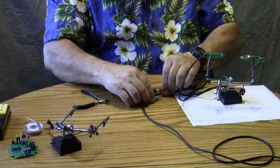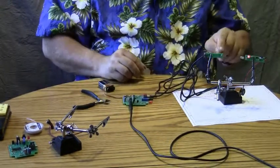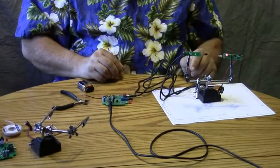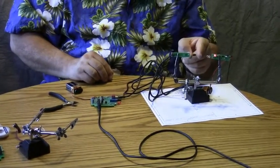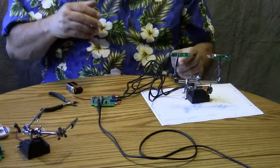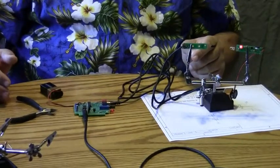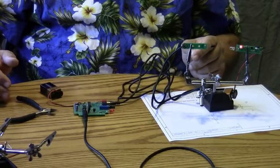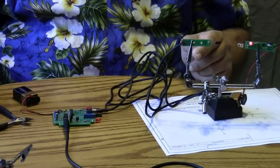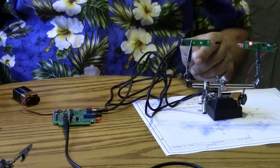But as soon as we connect the IR transmitter to it, the LED comes on, telling me that we have light on the sensor board here, and this is an IR transmitter board providing infrared light. So anytime something goes between these beams, the camera and flash will fire. Okay? It'll take about 30 to 40 seconds for it to reset, and after that, you can have something pass through the beam again, like a milk drop or ice cubes or whatever your heart desires, and you will get another triggering in the flash. And that's basically how the MD system works.